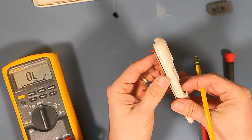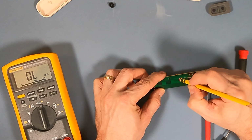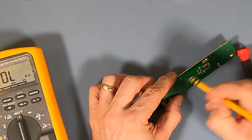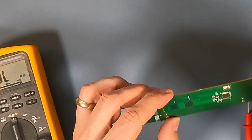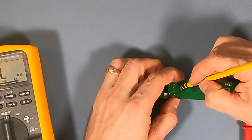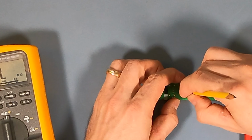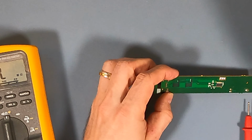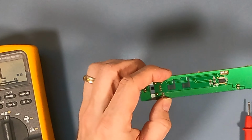Remove that battery again. See it brightening up a little bit. I don't know what this material is. I don't know if it's a silver paint or electroplate or whether it's carbon based, but I'm just gently cleaning off the surface there. See, it's got a little different sheen to it now. Do the same with this one. Just very gently taking the eraser to this thing. And that looks brighter. You don't want to go too crazy because I don't know how thick this coating is on here. You don't want to strip it all off.